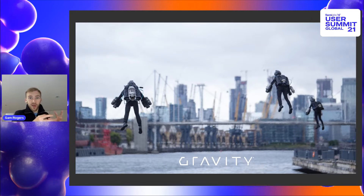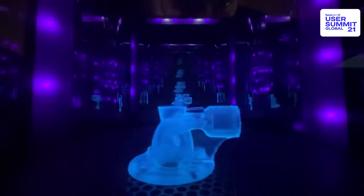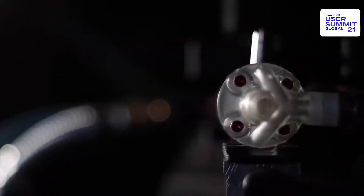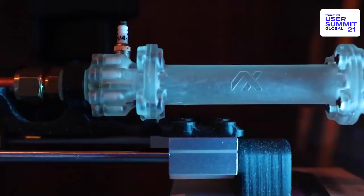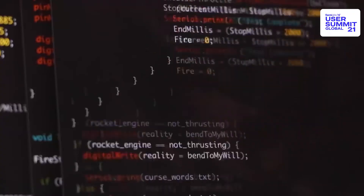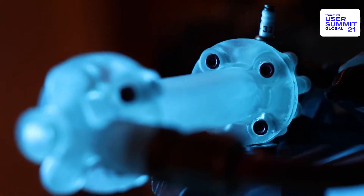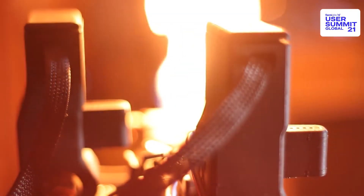I'll play the video now that shows these tests and how we iterated this design — really blowing up a lot of small resin parts — to the point where it was actually working well. We have servo operated valves, pressure and temperature sensors, and a high voltage spark generator for ignition, all mounted on a sliding set of rails that transfer the thrust through a load cell system. Timings for valves and the sparker are sequenced with a microcontroller. The first tests ran on propane and compressed air to get an estimation of valve and sparker timings to reliably ignite the chamber. Then we were ready for pure oxygen. The spark igniter activates before the valves open so that the propellants are ignited as quickly as possible. If oxidizer and fuel build up in the chamber then ignite, you can get what's called a hard start — which is basically an explosion that breaks things.